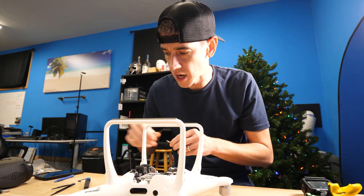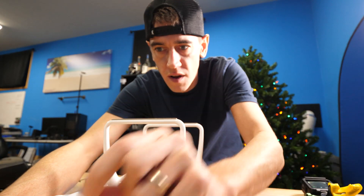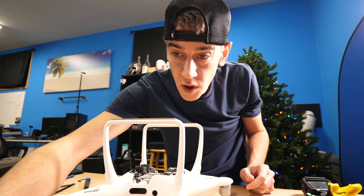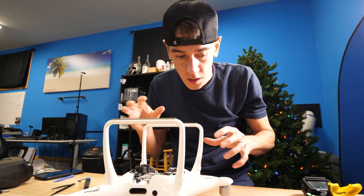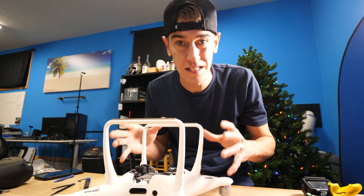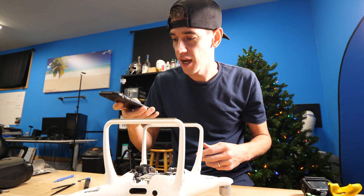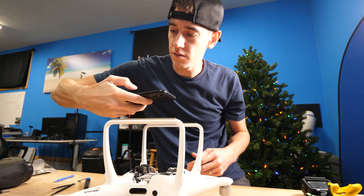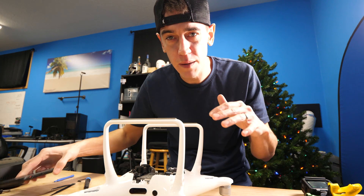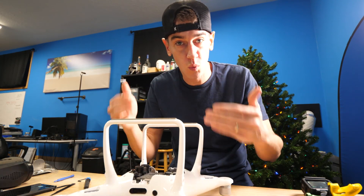I like to try and keep very organized with the parts that I pull off. So if I pull off a bracket and it's got screws with it, I'll set those together so that while I'm reassembling the drone, I know what pieces go with what and where screws go. It's also nice to take pictures — as you're taking things apart, just grab your phone and snap a quick pic so when you're going to reassemble, you have as much information as possible about what parts go where.